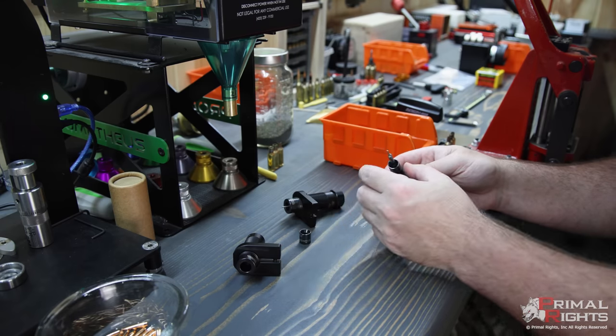Suffice it to say, if I leave this die set in this position with the 20 caliber in there, I'll always be able to take my normal die, like my normal die that I use for firing after firing in 20 caliber, I would take that bushing out and put the 22 caliber bushing in here, and then grab a new batch of brass, size it down to 22 cal, and then set my false shoulder with this other die.